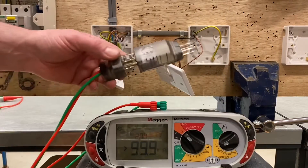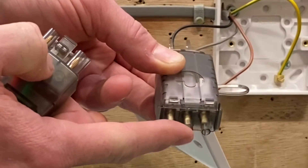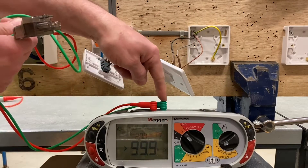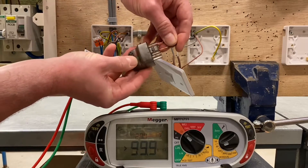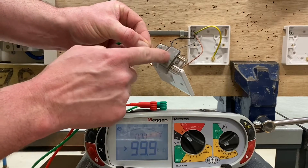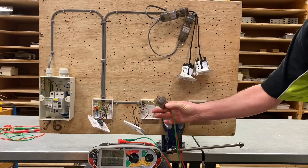Now I need to check at the lighting points themselves, which is where my new adapter comes into play. We've got an easy-fit connector here from Collingwood, and Jojo struggled to get onto these terminals previously. So I've made a test lead using one of the other ends of the easy-fit connector, probed into the red and green sockets on the instrument. I've made a small link between the conductors to zero out the resistance of the lead — a small piece of copper. This makes it very easy to get onto the lighting point and prove continuity, CPC, and polarity.